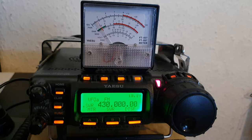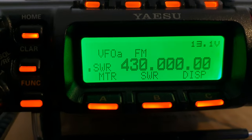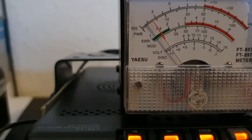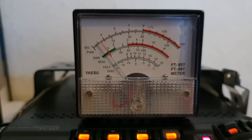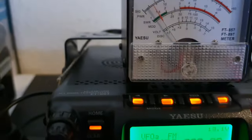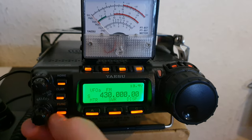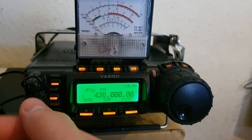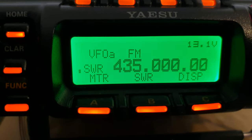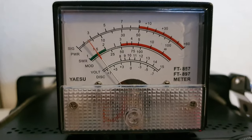It's hard to see, but there are three dots — two dots side by side and then three high — which is 1.5 on the SWR meter. I've heard that before, years ago on the internet, and someone else mentioned that three dots represent a 1.5 SWR. Keying up again on 435, that's again three dots high, which is 1.5 SWR.